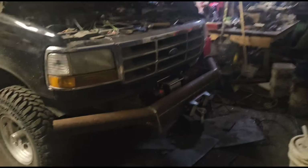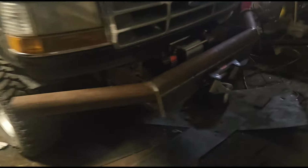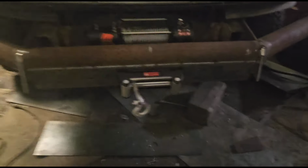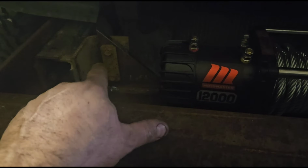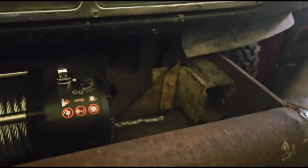Magic. So I worked even more hours today. So it makes it hard to get anything done on this thing when you work a pile of hours. But as you can see, I got the plate mounted in the front. That's a thick plate because that's where the fairlead's going to be. And then I got the support brackets welded in. Those are the factory bumper mount bolts that are like a gang bolt. And you just use them and the factory mount nuts. And everything just lines up.